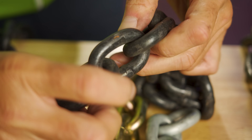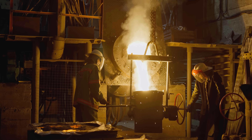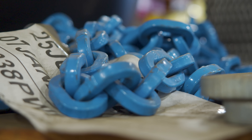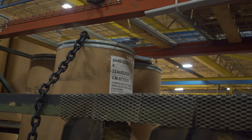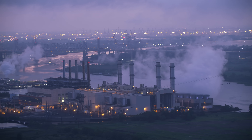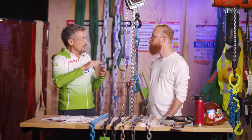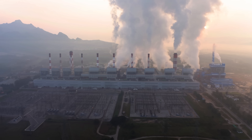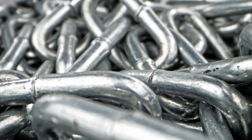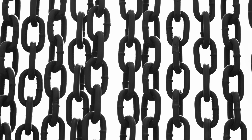Grade 80 is ideally suited to exposure to relatively high temperatures, so if you're in a forging plant or anywhere exposing rigging equipment to very high temperatures, you want to know who made that chain and who the producer is. Is it a reputable producer using locally sourced raw materials and steels? Does the producer belong to a system with a reliable power supply? The worst accident during chain manufacturing is running out of power — if the current used during welding of chain links was off, you could have one chain link that becomes a big problem.